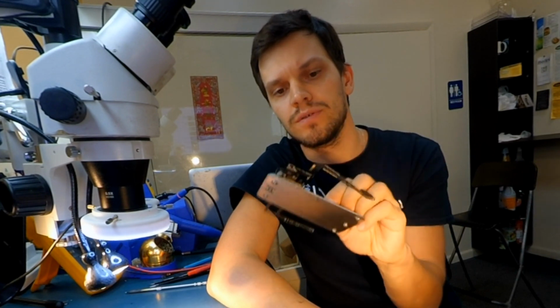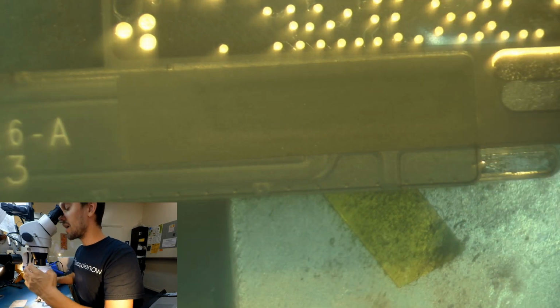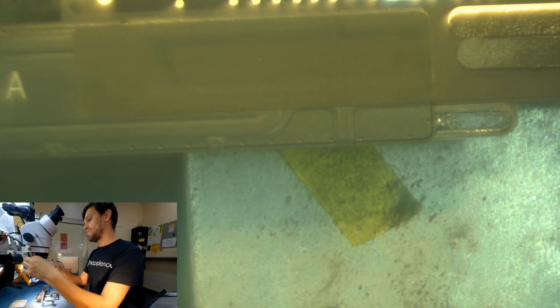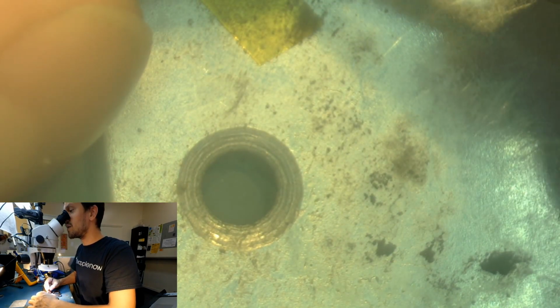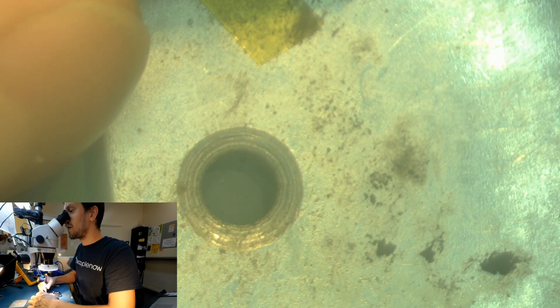So we have already taken the iPad apart, and we'll show you how to do the charge port replacement on these. It can be done either with the hot air or with the soldering iron. With the hot air, it's probably a little faster, but at the same time, it's a bit riskier, because you don't want to warm up things that don't need to be warmed up. The soldering iron is a little slower but safer.